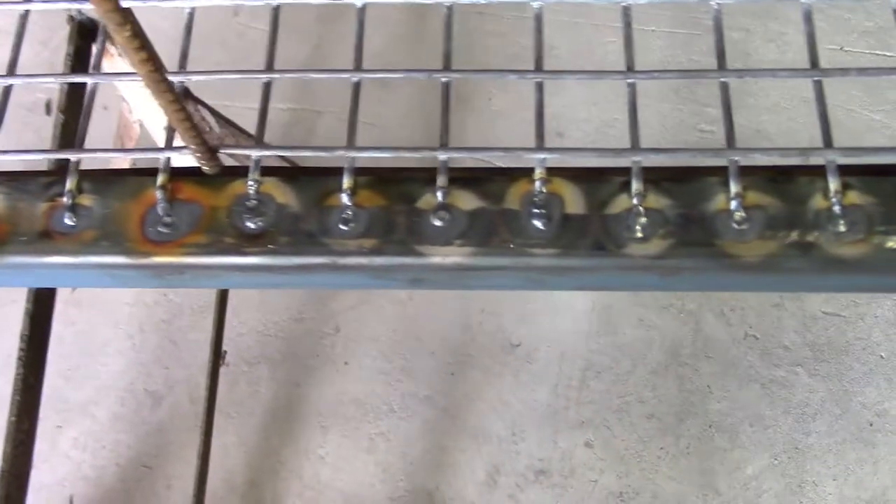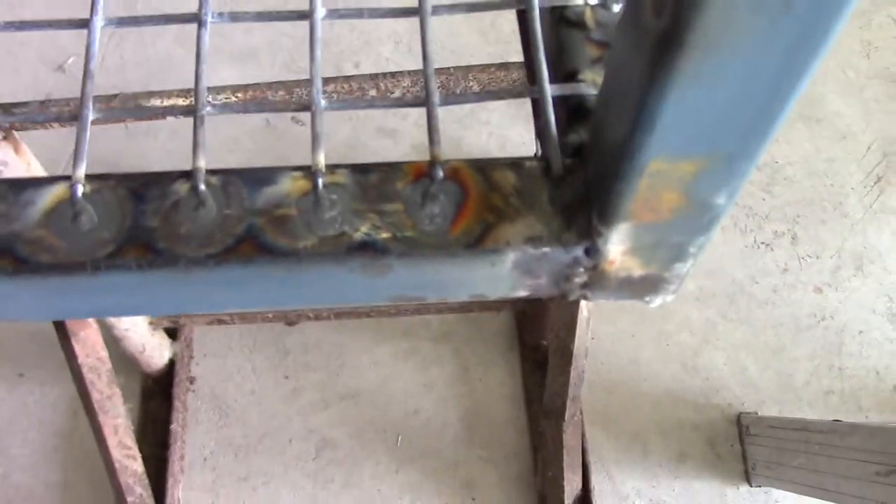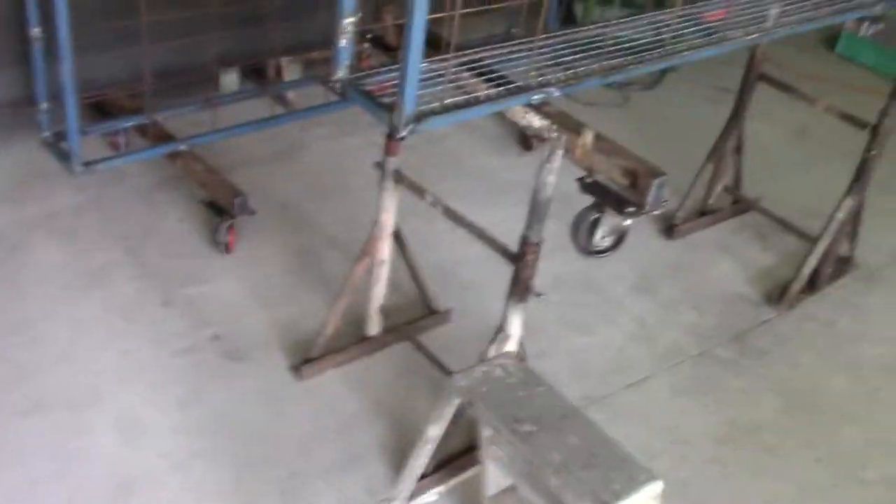This is what I ended up doing — I've gone along and tacked the end of each of those wires from the bottom mesh. Originally I'd intended to tack weld the ends of the meshes onto the frame, but when I found that the only mesh you could buy was galvanized, I decided I wouldn't do that, mainly because galvanized fumes aren't very good for you. But seeing the sharp ends sticking there and knowing that little people will find a way to scratch themselves on it, I decided to go ahead and weld it anyway, mainly just to get rid of the sharp edges. In a well-ventilated room, taking proper precautions and wearing a respirator, there should be no issue. But if you don't know about welding galvanized metal, it is dangerous and possibly deadly — do not do it unless you understand the risks and know how to mitigate them. End of lecture.